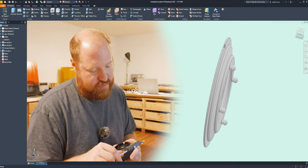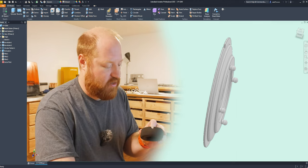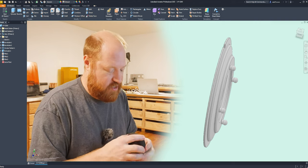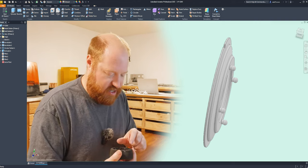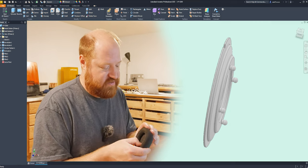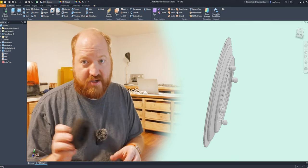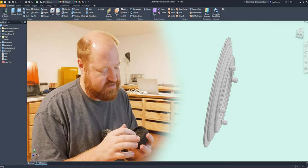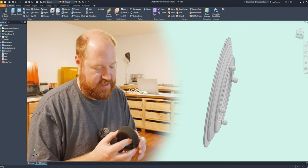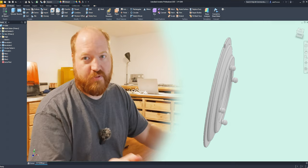We're looking at about 0.025 and I know the o-ring on here is a 139, so calculating that out it's about a 20 percent squish which is normal for these. They're pretty soft but they're not the softest I've felt, so I've decided to order the softest variation I can. I also got one that's an eighth inch thick instead of 139, and the reason for that is when you're wearing these and they're pressing against the ear you can feel the plastic behind the screen — that is actually the surround of the o-ring. So by going with a slightly smaller o-ring the protrusion of the plastic against your ear should be less, and with that thinner o-ring and reducing the offset it'll be more comfortable when we print the next ones.